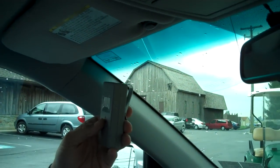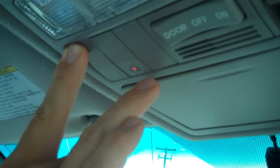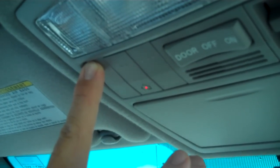From that point, you're going to take the garage door opener that you would normally have and you're going to simultaneously press buttons on the garage door opener and this button on your HomeLink, holding that for a period of up to 20 seconds. You're going to see how it starts to blink slow, and once it starts to blink very, very rapidly, then you know that your garage door has successfully been programmed.